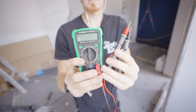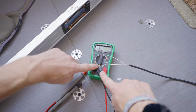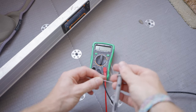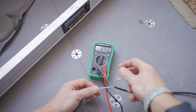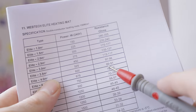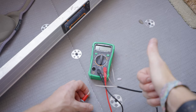To test it, you can basically just use a multimeter. To test the resistance, we turn the multimeter to the 200 setting, grab the cable which goes into the electric underfloor, and put the positive and negative onto the two cables. The value which appears should be around 90 — it says about 89 to 90-ish. So 88.9 is absolutely perfect, meaning that this electric underfloor is all working okay.